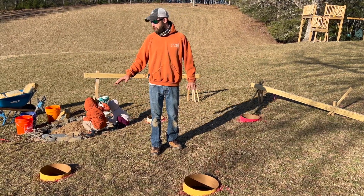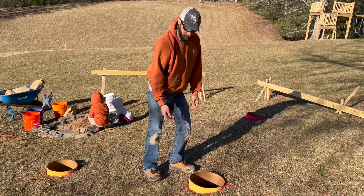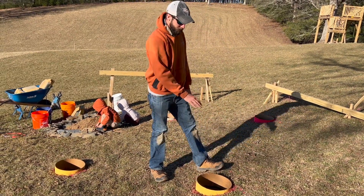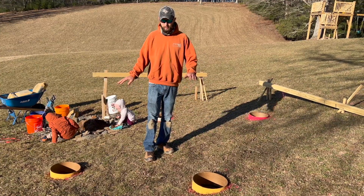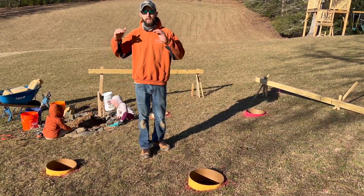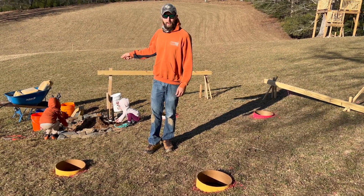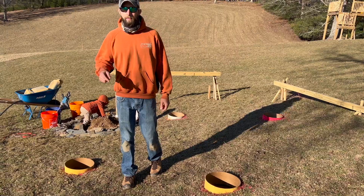We're finally about to do concrete. I'm doing these four holes first because they're the easiest, then I'll do the complicated ones after I've gotten used to the process. It's just a chicken coop so the rebar mesh is better than nothing — real simple, just setting it down in there and getting the concrete pretty level. These four are good practice holes because the exact height doesn't matter much; we just keep them level since posts come off these. I'm using a drill to mix — I hate mixing concrete no matter what, but this method I hate the least. I'll figure out my water-to-concrete ratio in a five-gallon bucket and be more confident when I move on to the more complex footers.